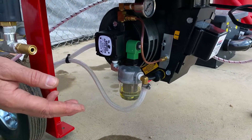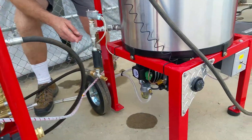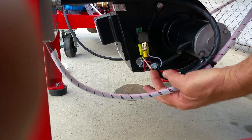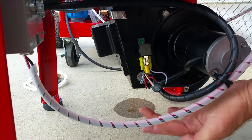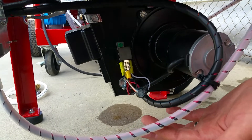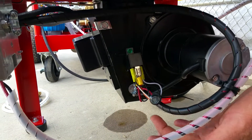If you need to check the power across the circuit, there are also indicator lights. On the other side we've got an indicator light that tells us we're getting power from the control circuit to the relay. This is self-diagnosing — with the fuel pressure gauge to tell you whether you've got good fuel pressure, and the indicator light to tell you whether you have a control circuit being turned on.